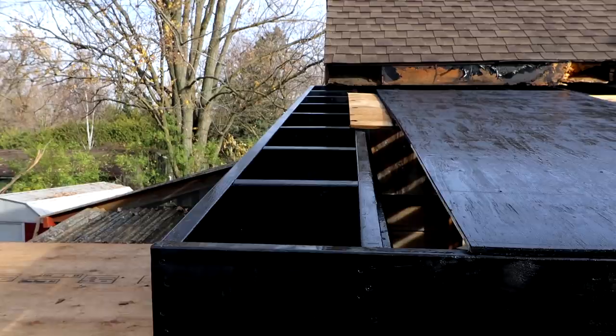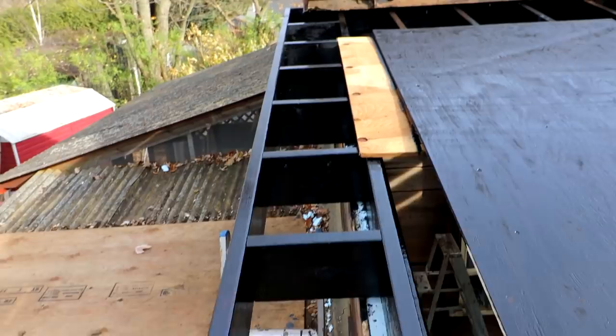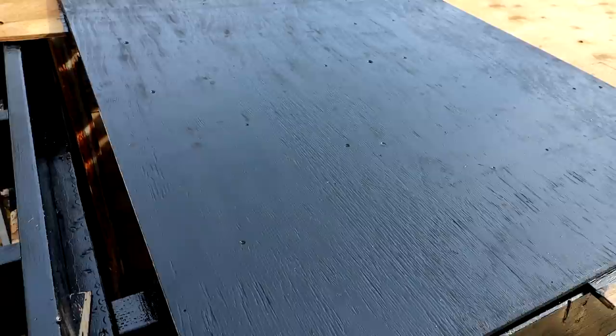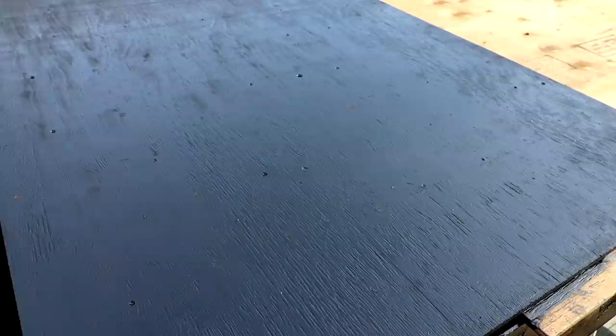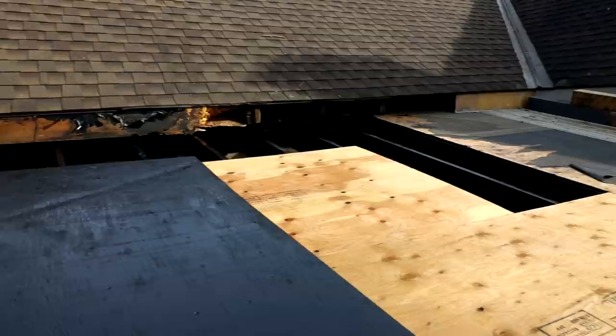Here's my roof extension - I finished that all up, got it all nicely nailed together, nice and secure. I've got a lot of plywood panels up here. I put the black tar on the new one and then I'll flip it upside down - that'll help seal it because that'll be the cold side of the roof. If I get any condensation, at least it won't soak into the wood and start rotting it away. I'm going to tar all the panels like that. I've tarred up all the beams as far as I could reach and I may have to touch up some.